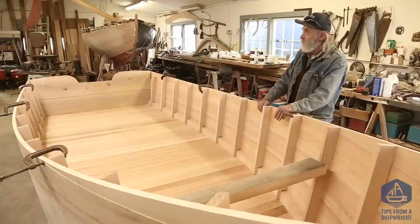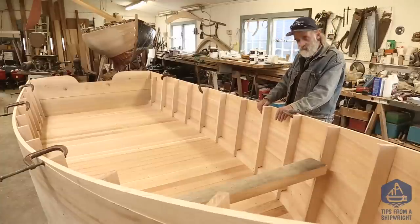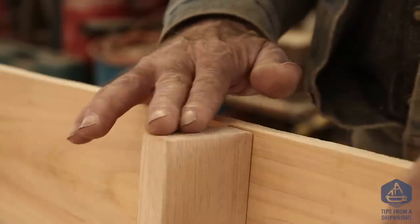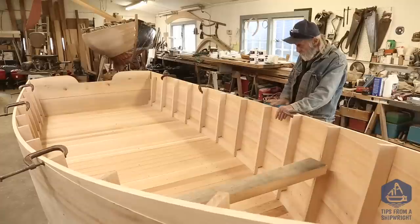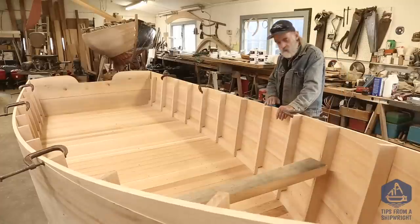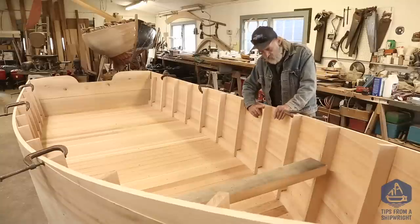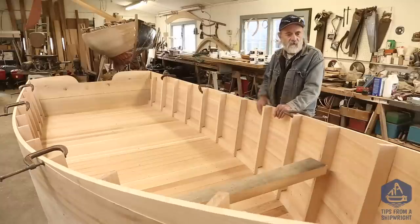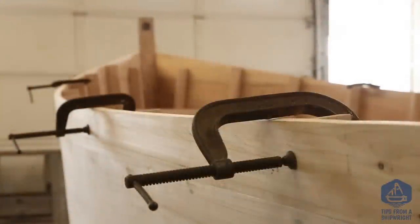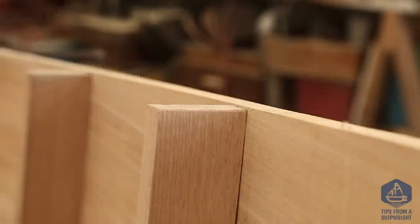Most tong boats might have been a little bit lower sheared up forward than this but it doesn't really matter. It's got a nice graceful rising shear back aft just about an inch more than it is amid ships, and I think that just makes the boat look a little bit better. It wouldn't make any difference in the way the boat performs if it didn't have that, but you're trying to make it look good as well as be useful. So this is what we've arrived at right here - I've got all the frame heads cut off just a little bit below this shear cut so now I can take a plane and just plane this out a little bit without banging into the frame heads. She's ready to put the gunnels on it.